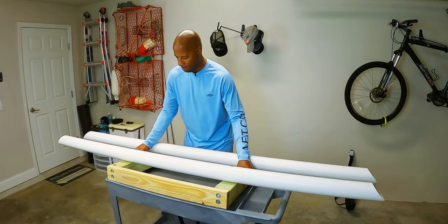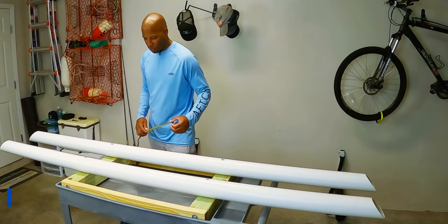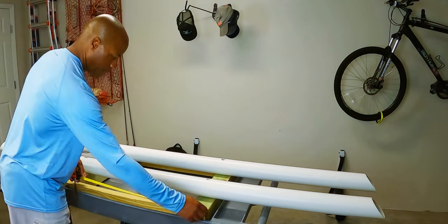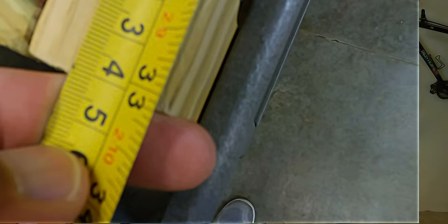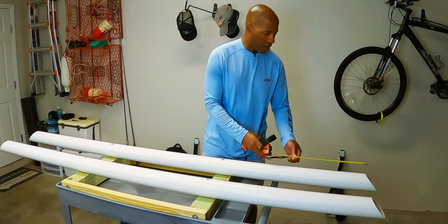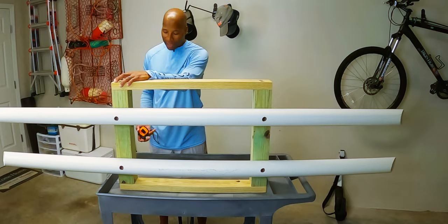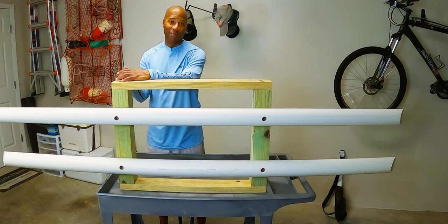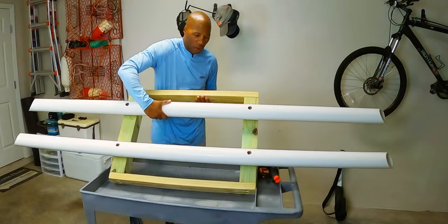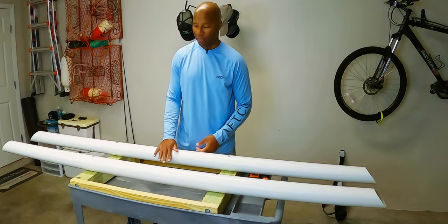Another good thing about keeping this shorter is that you don't crush your knuckles when you're lifting it and putting it back in. Some of the measurements: the 2x4 is right at 33 and a quarter inches. The pipes themselves — the tubes — are exactly eight feet long. These 4x4s are 21 and a half inches. That gives you one sixteenth of an inch of play. Not much play, but if you build a square box, you're not going to have any issues whatsoever — it'll fit right in there just like that.